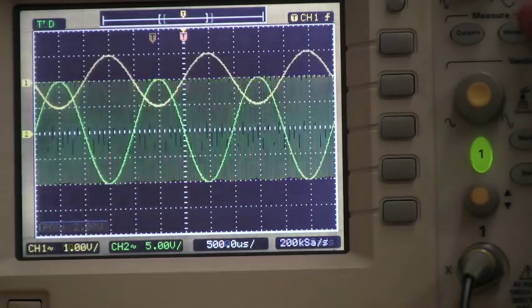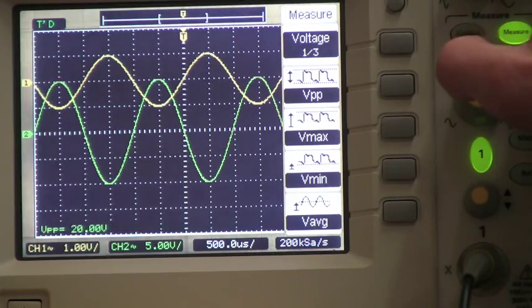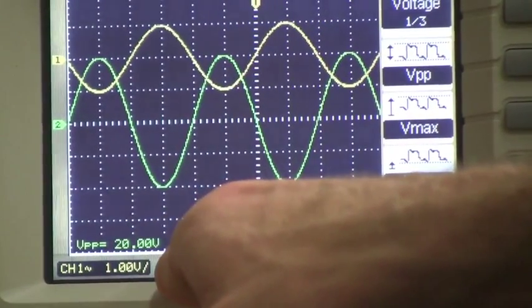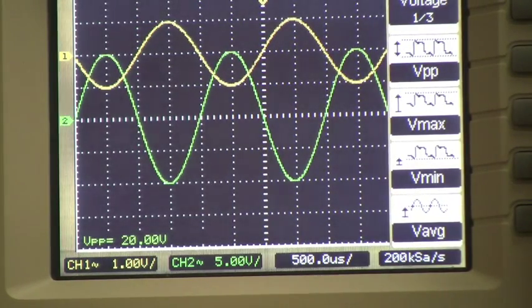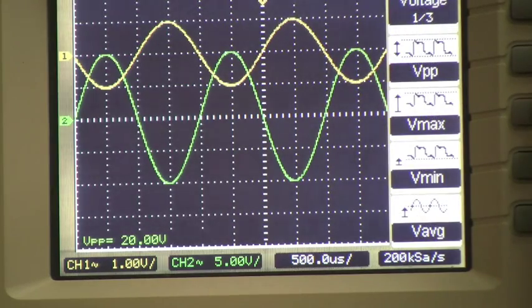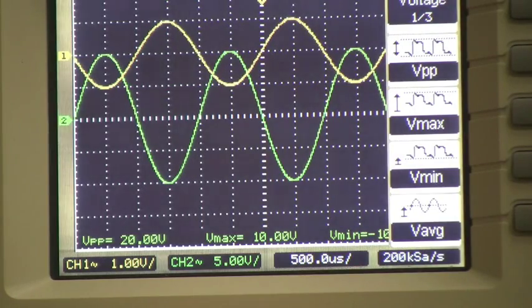So using the measure button, we can find stuff such as the peak-to-peak voltage, which you can see it gives us the peak-to-peak voltage of 20 volts for our channel 2 output, which is exactly what we would expect, seeing as the amplitude is 10 volts due to our operational amplifier having a gain of 10. Other things that can be found are the Vmax, which is 10 volts, which is what we would expect, as well as Vmin. Everything keeps popping up down here so that it's easy to record.